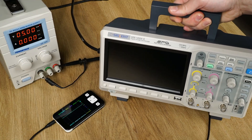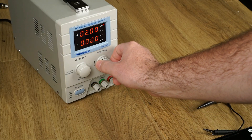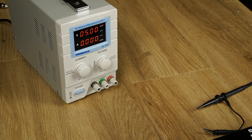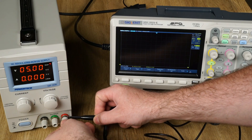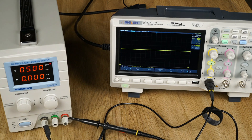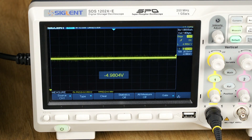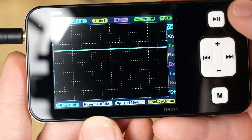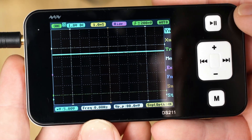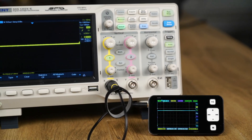A lot of you are probably wondering how the DS211 stacks up to a full desktop oscilloscope and what the limitations are. As a benchmark I'll use my benchtop power supply set to 5 volts DC. The ripple from the power supply is only around 15 millivolts, which is easy enough to inspect on my benchtop oscilloscope. However, on the pocket-sized DS211 it's difficult to inspect such minuscule ripple. This isn't really a criticism — I'm just highlighting some of the limitations a $65 scope has to offer.